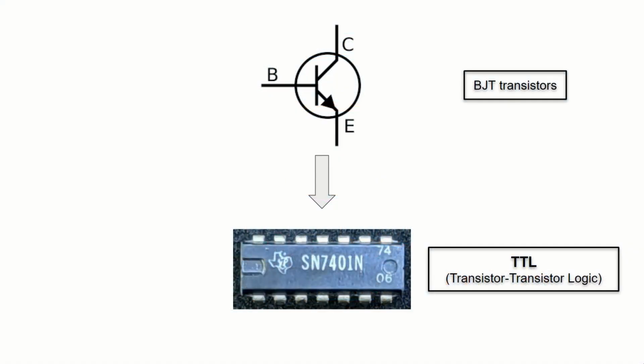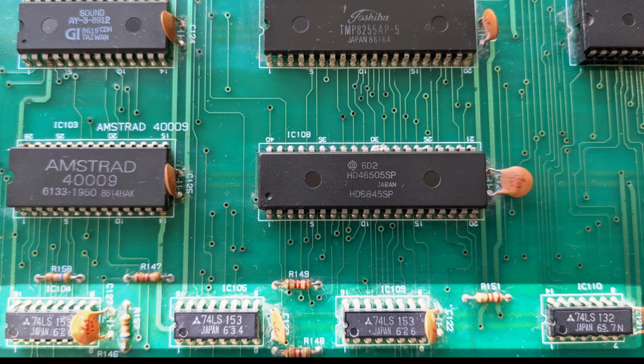In this first introductory part, we will talk about what 7400 chips are and about differences between their multiple families. 7400s are also called TTL, transistor-transistor logic, because the first original family of those chips, introduced in the 1960s, was built using bipolar or BJT transistors. 7400 integrated circuits are basic blocks of digital electronics, often used as gluing parts between more complex chips.